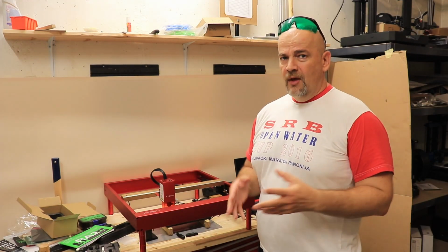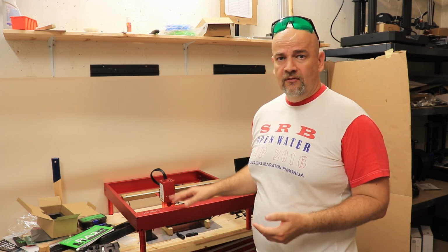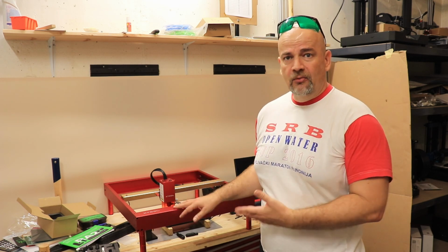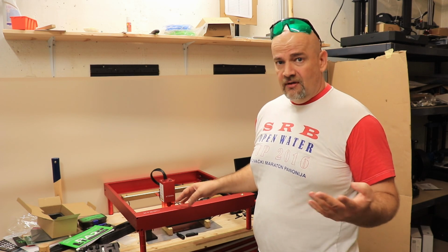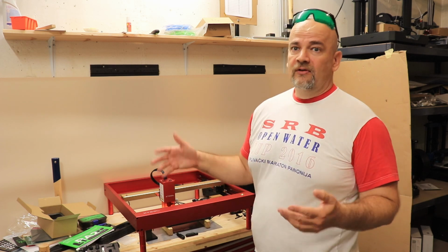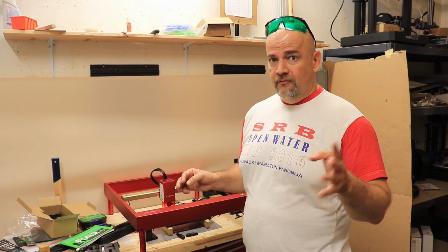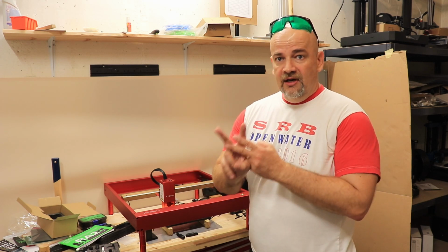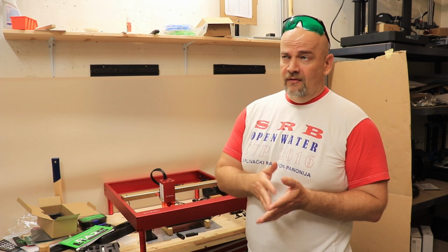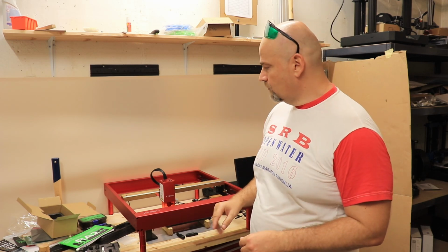And now the conclusions. Well, this video is a little bit shorter than usual because the detailed instructions you can find on xTool's official YouTube channel. In this video I just wanted to show you what we can do with this laser engraver, which is actually great. Let's start with the module. One of the strongest, if not the strongest laser module I tested so far. You saw with that MDF wood cutting, only 2 laser engravers which I tested can cut it in 2 passes. With all others I needed at least 3, sometimes even 6 passes to cut through that 3 mm MDF.